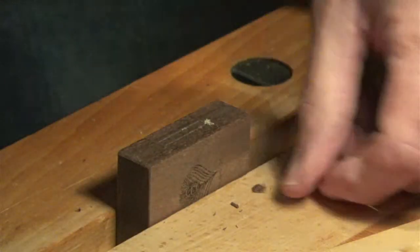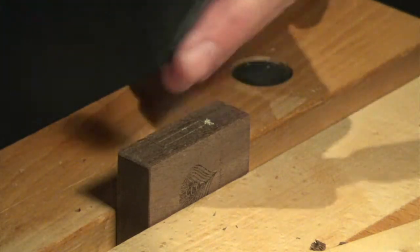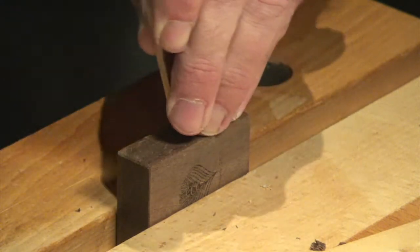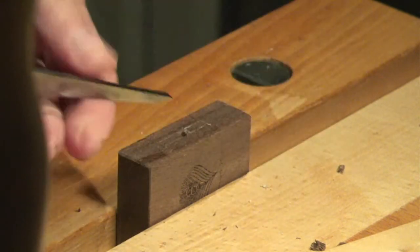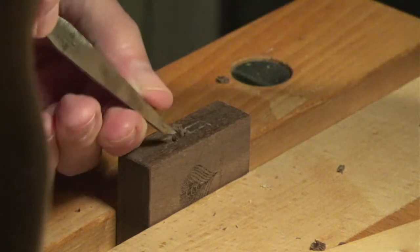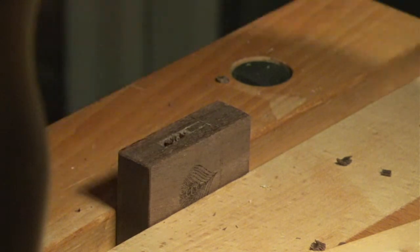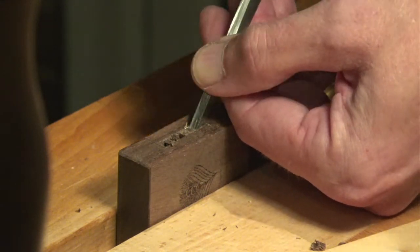When you're chopping in a vise, or when you're doing anything in a vise, remember if the screw is nice and tight, then there's not so much force down on the screw itself. It's friction on the cheeks of the jaw. In fact, in some woods, and probably even in this one, I could do it without using the mallet at all. I could probably just use my weight. In case anyone's wondering, this is a piece of walnut. So it's quite amenable.